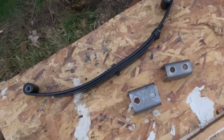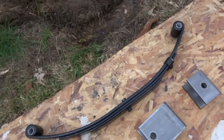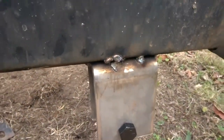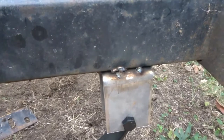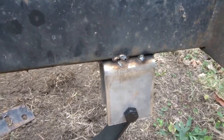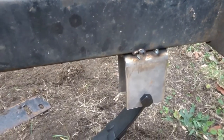The next step is to start working on getting these hangers hung and get this spring mounted up, and then get that axle mounted. I can't really weld with the welder that I have right now. My welds kind of look like this — they're sloppy, they're not penetrating at all. What's going on is I have a MIG welder that can also do flux core, but I don't have the right tip for flux core, so I'm running MIG wire without any gas and it's definitely not penetrating enough to be safe right now. I thought it would be a decent shot just to tack it on, but I can't even bolt the thing up as it is.